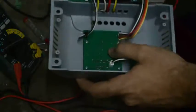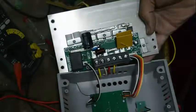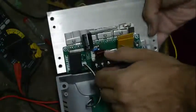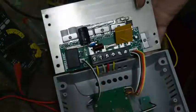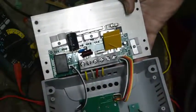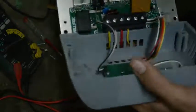This is the Will-See MPPT battery charger from the inside. As you can see, we have two circuit boards: the main controller circuit board and the power circuit board. The power circuit board has all the power transistors and power diodes, connected directly to the large heat sink. Now I know the reason behind the voltage fluctuations — this small air-core inductor. This indicates the inductor has a small inductance, which means that if a high frequency is not used, the output of this charger will contain a high current ripple. I don't know why they didn't go for a ferrite-core inductor.